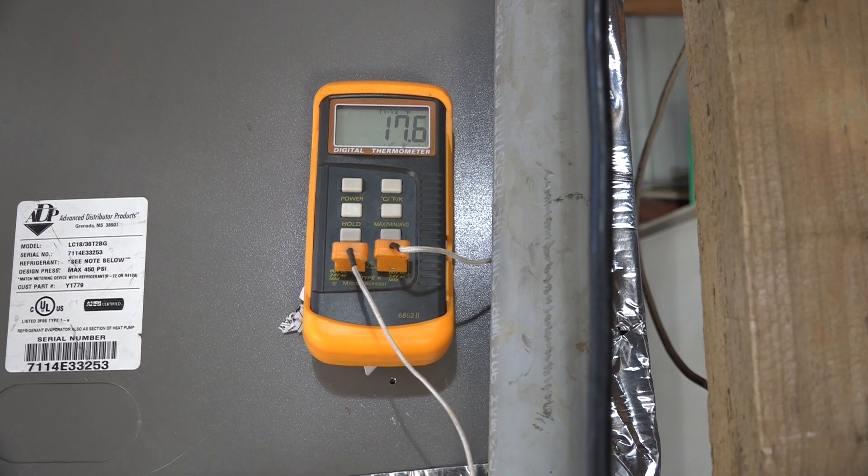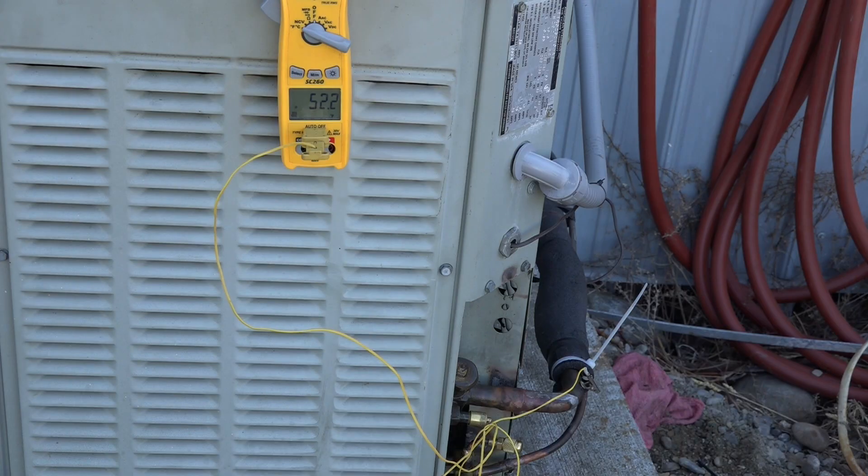This is kind of the last thing you do, but it's actually the first and last thing. I usually check the temperature of the suction line outside before I get started — this is a final check to make sure I have the proper charge and that it hasn't leaked down. I've put a temperature probe on the suction line at the outdoor unit and I'm showing about 52 to 53 degrees.